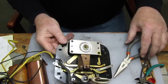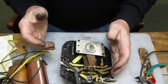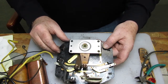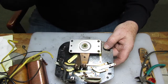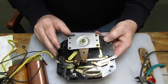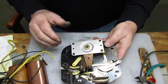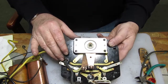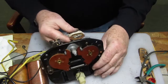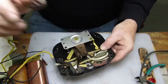So now we have two brand new rollers that are going to last probably for another 60 years or so, I hope. One important thing: when you use these machines for accessories, you tend to leave the throttle on the same place to get the right juice into the accessories, and that tends to wear down the rollers. Make a habit of changing the throttle settings for accessories and for the trains so that the rollers are not always on the same spot on the coil — they will wear evenly and last far longer if you do that. Okay, that takes care of the rollers. Now we're going to go off camera, get a new rectifier disc, and I'll show you how to replace it.